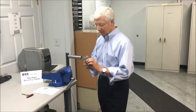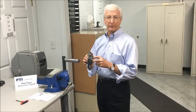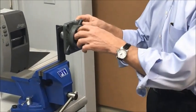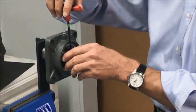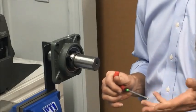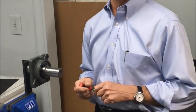The first mounting style is a set screw mounted ball bearing — a slip fit to the shaft, tightened using two set screws. Once the bearing is positioned and the flange bolted to the frame of the equipment, the set screws can be locked down with an Allen wrench, typically using a torque wrench. There are instructions in the manual on how tight to tighten each set screw, and after 24 hours of operation it's a good idea to re-tighten them.